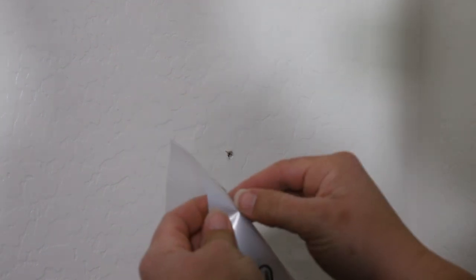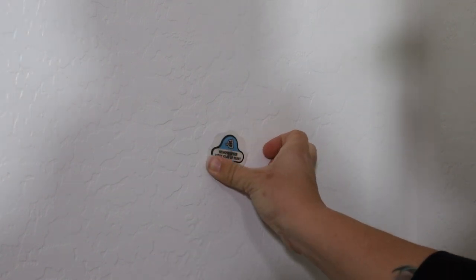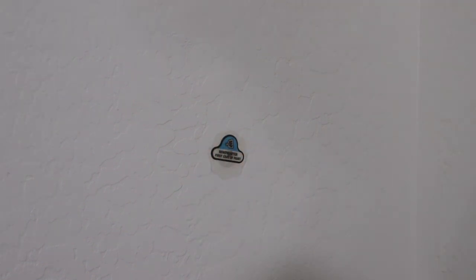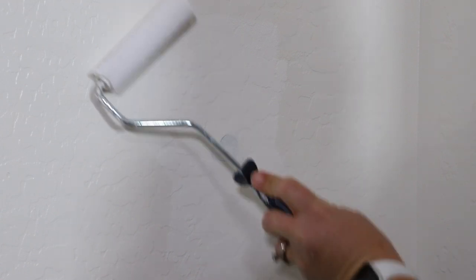There was a small hole on one side of the closet that needed to be patched, and my new favorite trick for this is using DAP Eclipse Rapid Wall Repair patches. You just stick it to the wall, paint a coat of paint on it, let it dry a bit, and peel off the applicator, then paint over it with a few more coats of paint and it's like there was never a hole there. DAP recommends that after removing the patch's protective layer, you immediately apply texture using an aerosol spray texture or textured paint rollers to match the existing wall surface, so the patches blend in better.